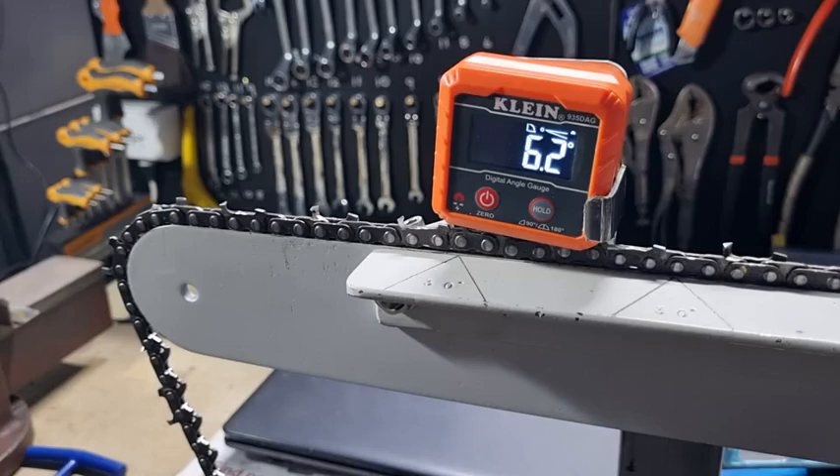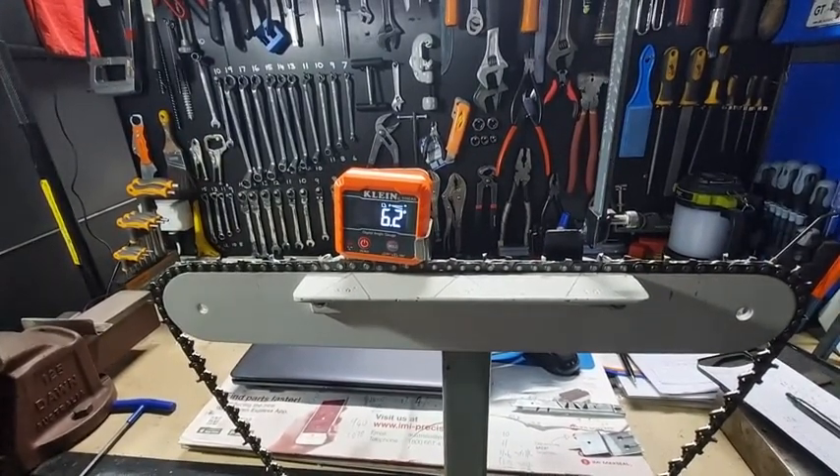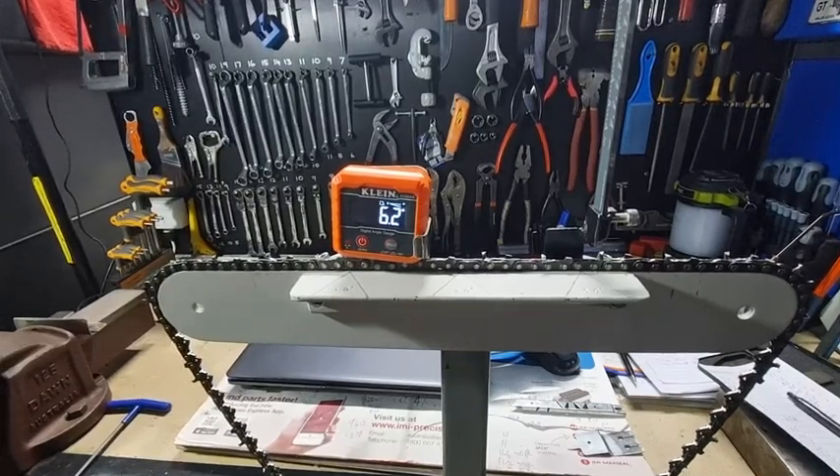Now, also worth mentioning that for hardwood a good attack angle is between 5 and 7 degrees, and on softwood it can be as much as 7 to 9 degrees. This would also depend on the saw — obviously the more powerful the saw, you can have a slightly higher attack angle. But I'm not suggesting that you go out and buy a gauge like this; all I've done is use this equipment to try and find out what sort of attack angle we've got. Attack angles are on every bit of woodworking equipment — whether it's a plane, a chisel, a drop saw. Attack angles are everywhere. They're in sports — when you swing a golf club and hit a ball, that's an attack angle. When you use a lathe and have a cutting bit touching the metal, that's an attack angle. So attack angles are very important.